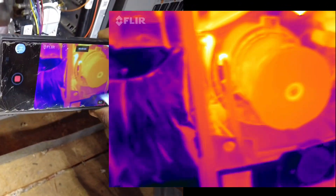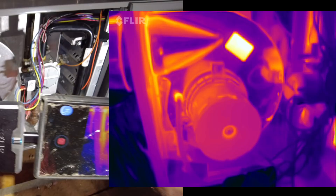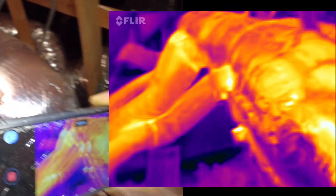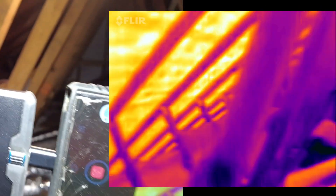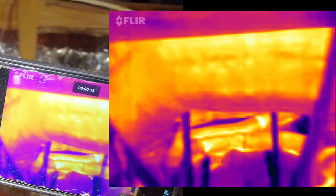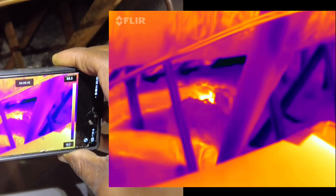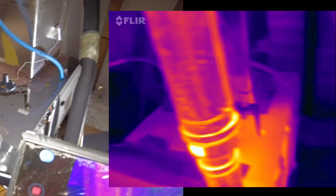Now comparing with the FLIR: it's not capturing the spinning of the shaft the way the Thermal Master did. It looks really good with high-temperature subjects because the thermal sensitivity isn't as good — you need a pretty large temperature gradient for it to look this good, otherwise it's kind of garbage. The roof there looks decent. It did capture the hot spot in the back corner, and it found the duct leak at the boot — that's exactly what a boot leak looks like.